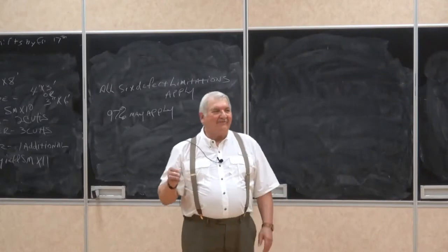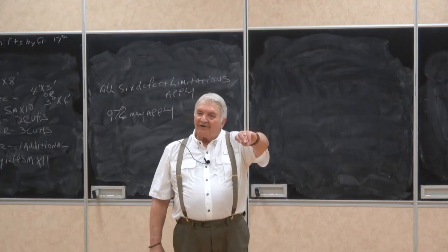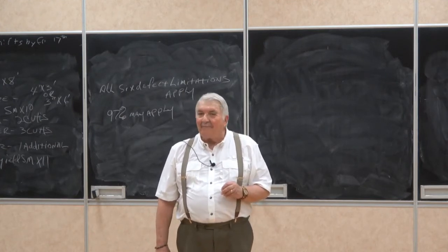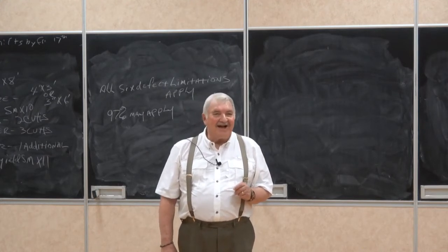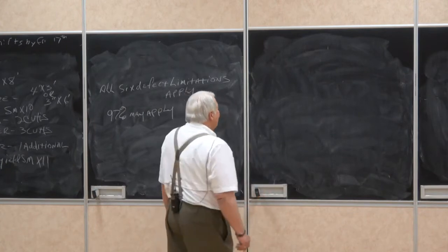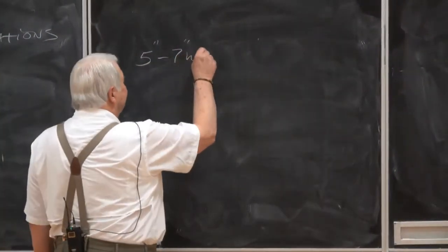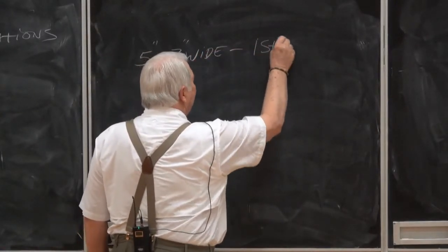6 and 7 foot FAS walnut, Josh. All you defect lookers, you get to have a good time now. All other times we're looking for clear wood. Now you can have a good time, because that's defect grading. Now we're looking for defects. I hate to say that, but that's what it is. All right? If you have a board 5 inches wide through 7 inches wide, you're allowed one standard defect.